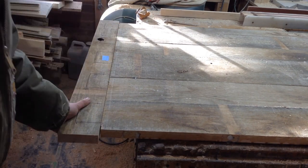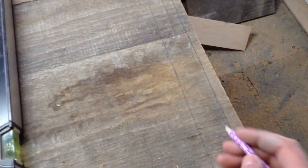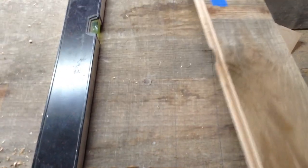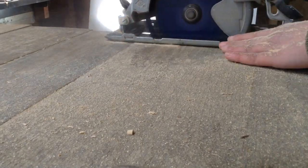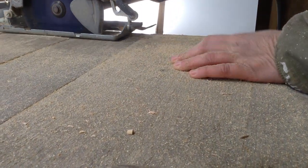It's a lot of engineering that goes into a piece no one ever really sees, but it ensures this tabletop will last a very long time. Anyone who's made a tabletop without breadboards, or seen one made improperly, knows the nightmare of a top that moves, cracks because it can't move freely, or has other issues from improperly made breadboards. Once one side is done I go through and mark for the other side — I think it was somewhere around 72 inches, not a finite dimension — and repeat the exact same process: rip the boards clean, route them, and cut everything.